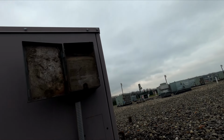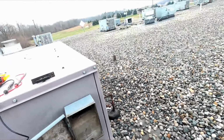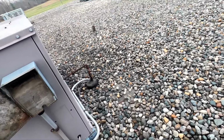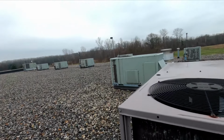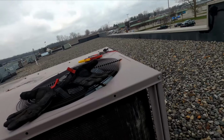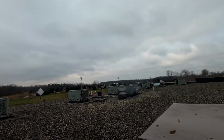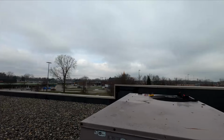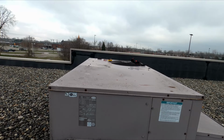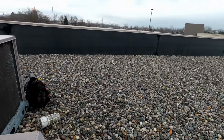Okay, this is our guy. We gotta set the cooling. Let's see. That spins. Let's go over to compressor. Bet you this thing's compressor shot. They've been running it like this forever, so slow. 4-ton, 230 single phase. I guess we're just out here changing filters.